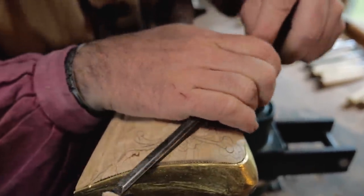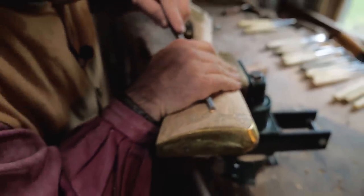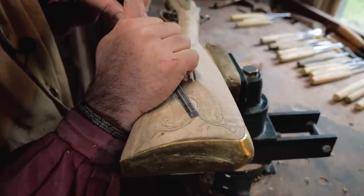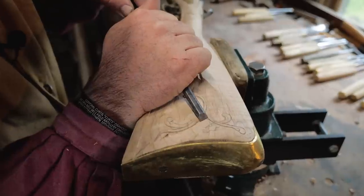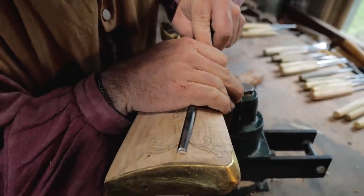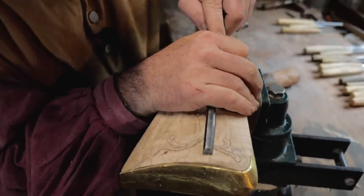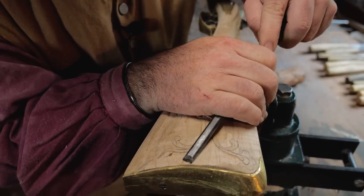You want to hold pressure away from your carving when using a chisel. When I'm coming through here, I'm actually pulling my chisel this way so that if that wood breaks loose or I slip, I don't go into my carving — I'm holding a little pressure so that if anything, it'll shoot out this way. There are lots of different ways of doing this, and this isn't the way a lot of people would prefer, but it's what works for me.